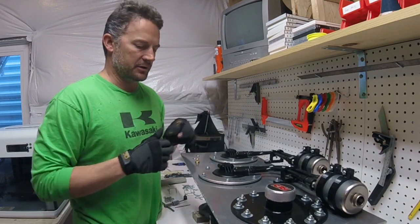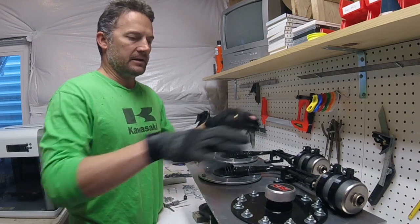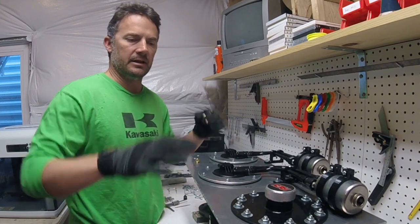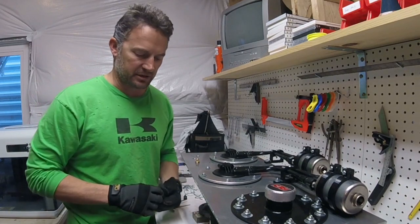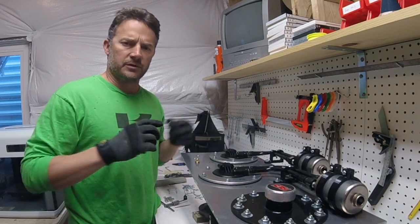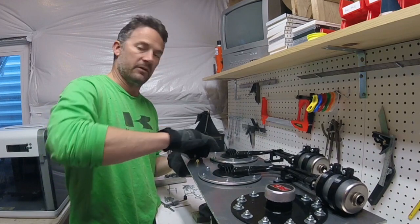What I need to do now is, once I get these threads taken care of, take all the stuff off, take all the bolts out, take it up into the garage, solid weld it, and then solid weld the whole fuel cell. That's a big project because my TIG welder is air cooled, not water cooled. So on something like this, I can only weld for so long before everything heats up and I have to stop and let it cool.